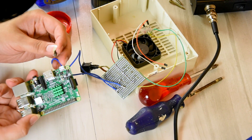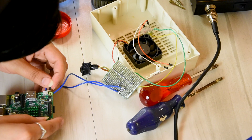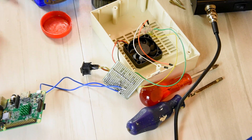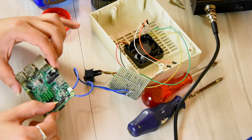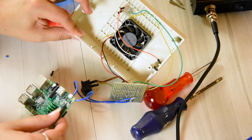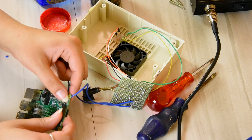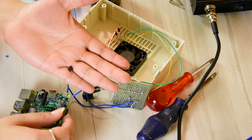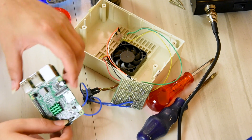It pulled out of the circuit itself. I don't know if I'm gonna be able to have an activity light or not. Basically what happened - and I'm a little ticked off about this - is when I was opening this case, because of the Milliput I had to yank it open. These two wires pulled the header, and instead of coming out of the header, they pulled the header right off the circuit board, which has taken the tracks off the thing. So there's no way to solder this back on - the tracks have come off. So there's gonna be no activity light.